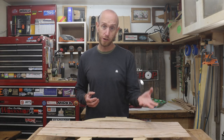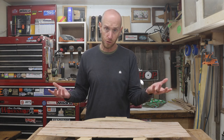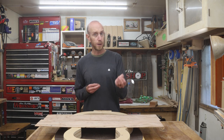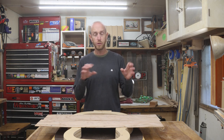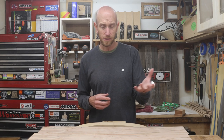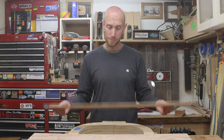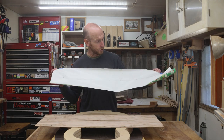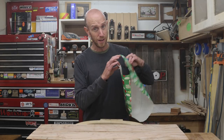On the first guitar build, my friend Matt over at Zimbelman Guitars gave me a hand with the bending since I'd never done it before. A cool thing he uses — and many other builders — is a template which has some of the taper built in. Trying to come up with this template was a little tricky. My plans have all the dimensions but don't show the exact profile of the sides, which probably varies from build to build. I did try taking Christmas wrapping paper, taping it to my existing acoustic guitar, and tracing out the profile — that sort of worked. But I think I found a cooler method that we're going to use.